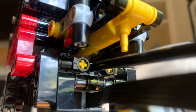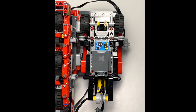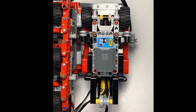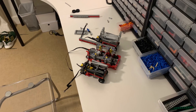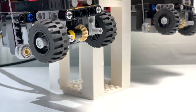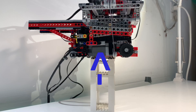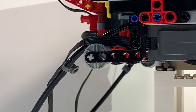Now I'm going to talk about all the different mechanical functions that make this robot possible. The first part of the build I started designing was the feet of the robot. These were super fun to design and build as they required a lot of functionality with a minimal number of parts to keep the weight and size down. Each foot has two tires driven by a motor and an extra third wheel for stability. Since the third wheel doesn't have a tire, the robot can use tank steering to turn.